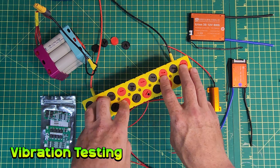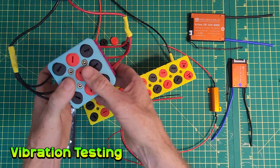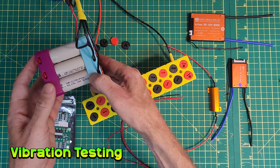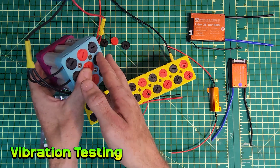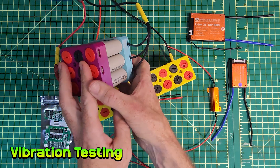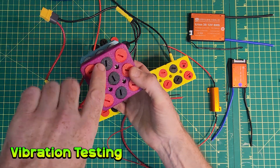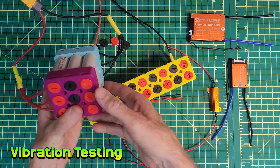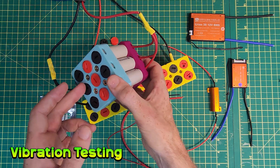The first thing to talk about is the vibration testing that I've been doing, and that's with this 12-volt pack. I've been loading this into a vibratory tumbler and I'm trying to mimic the effect of vibration that you would have on battery packs on e-bikes when they're in use. I've tested both the initial kit and the latest update, which uses M3 bolts to secure the two plates in place. I've had this pack vibrating for over three days cumulative time in the tumbler with no signs of degradation in the connections.